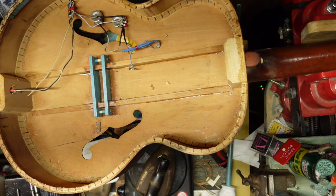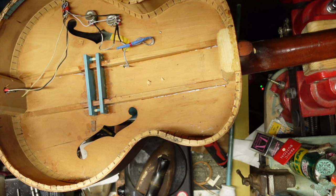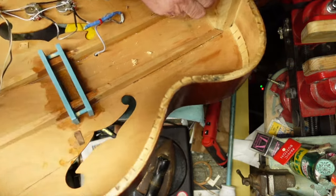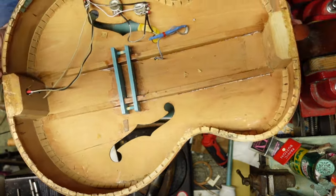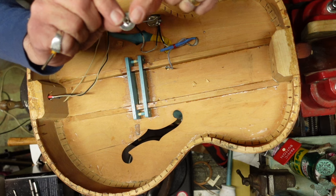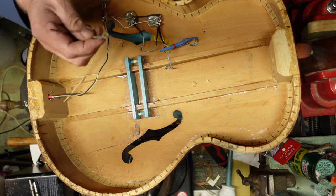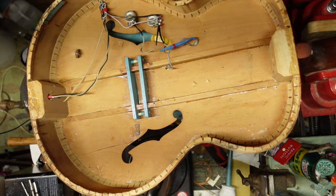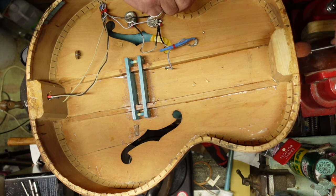Then on the back side, where the T-nut goes, you see that? The T-nut needs to be recessed down into there, like so. You see that? Of course, it's turned around. There we go. But once that's in there, then there needs to be a little bit bigger hole drilled for this part of the T-nut to go inside there. And then finally, when that's all done, you finally drill the hole that's big enough for the bolt to go through. So this here now will go through here, and it's tight enough where I will screw it in.